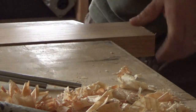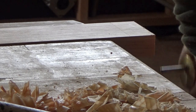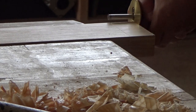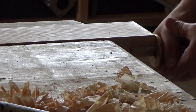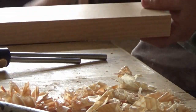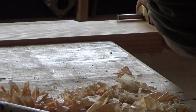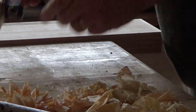I'm going to use a marking gauge and mark the tenons. The front feet are about an inch and a quarter thick, so I made these tenons come out further than that because I wanted them exposed. The idea is to have exposed tenons — chamfered, coming out of the face of the piece. I'm using my marking gauge to score the grain and get my finished depth put in there, ready for sawing.